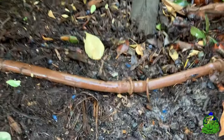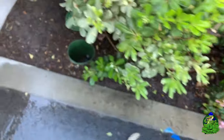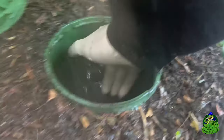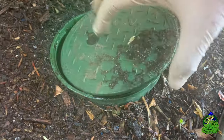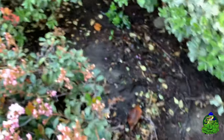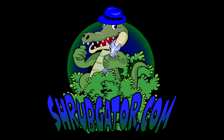If you've got a good layer of mulch over it, it'll be good. I turned everything back on and it's running — it looks good. Here's a drip line air release valve. I wanted to show you that real quick: if you have any air in the line after you've repaired it, you want to make sure you release that air, because if air is in there when the water's in there, you can break one of your emitters. That's it for today, guys. Thank you for watching. If you like my content and want to see more irrigation videos, please like and subscribe.